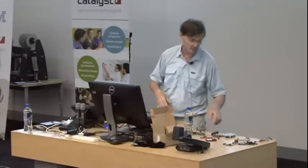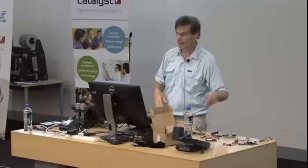There's a UART thread for all the UART serial operations for talking out to telemetry, also talking to GPSs if the GPS is a UART-based GPS. Not all GPSs are UART-based. The one on this board is actually SPI-based. There's an RC input thread for processing all of the RC radio input pulses from transmitters. There's a main thread, which is the bulk of the autopilot logic, with the navigation and that sort of thing.